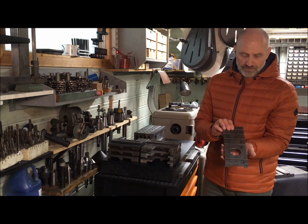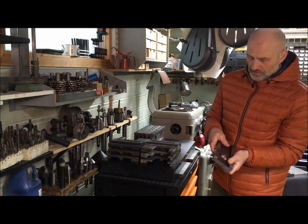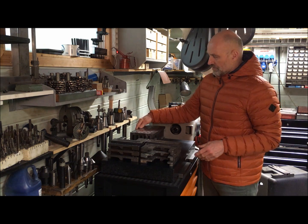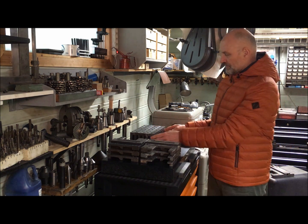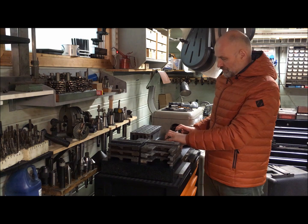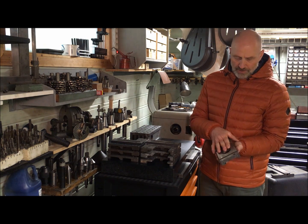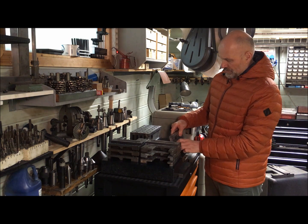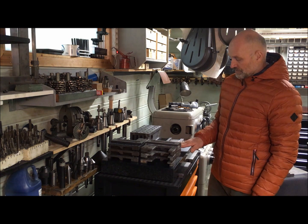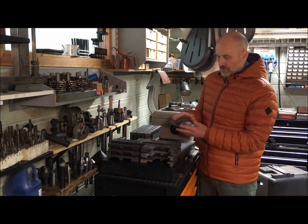Some of these came to me later, so for instance this one I have scraped. Results are the same, equally good. I did that so that I could have a reference plane. Of course this needs to be tested — you need to put it onto the plate and prove it's really flat, and so being a reference plane. With this done I have a good start to be able to measure the other sides of the cross slides and scrape them flat to the top.